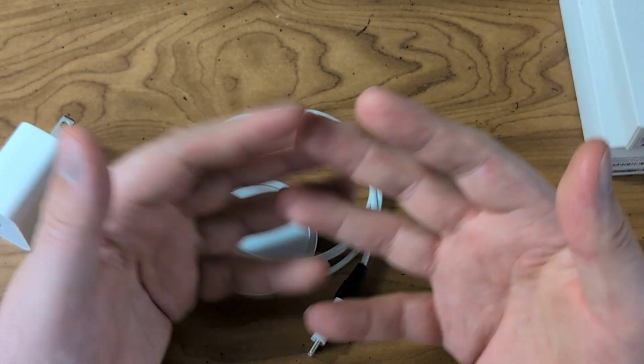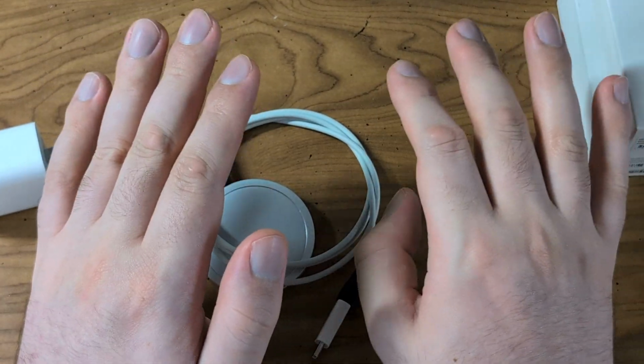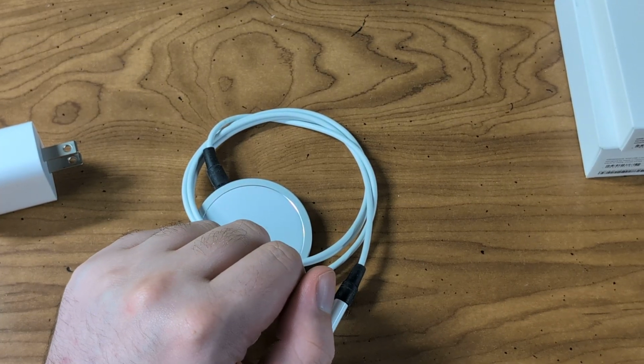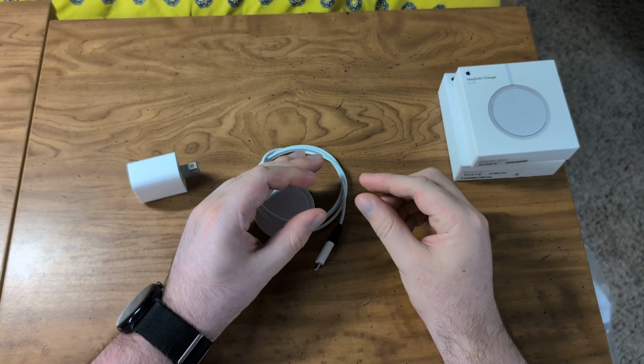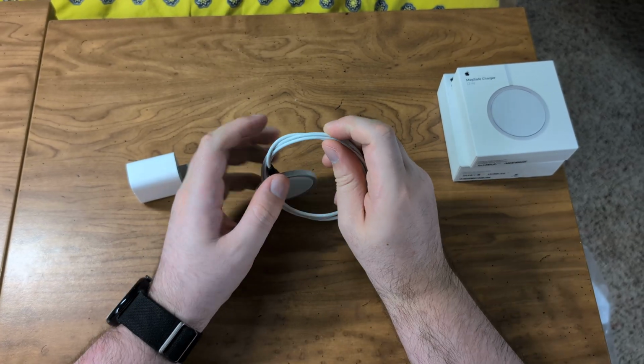Like, they don't do the PD handshake. And if you don't do the PD handshake, PD is just like, I'm not charging you at all, right? It just says no. So sometimes what you need is the A to C. It wasn't very often, but sometimes you need the A to C on the 5 volt 1 amp adapter, and that would resurrect the device.